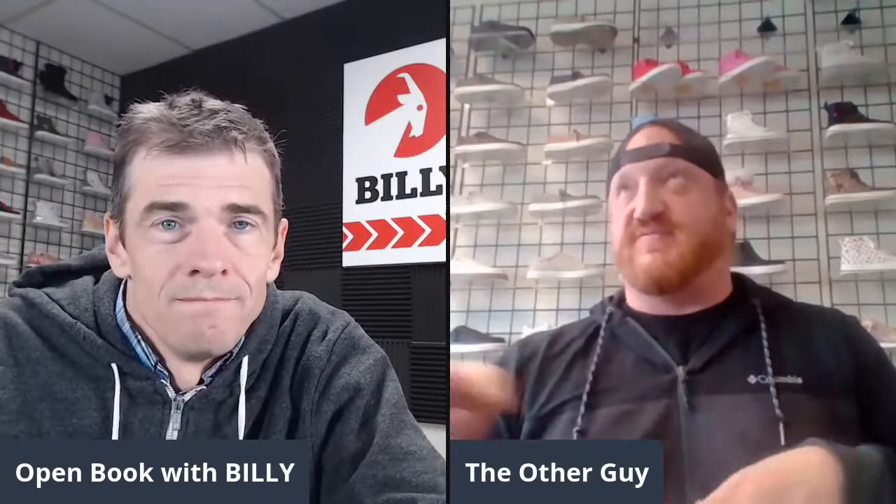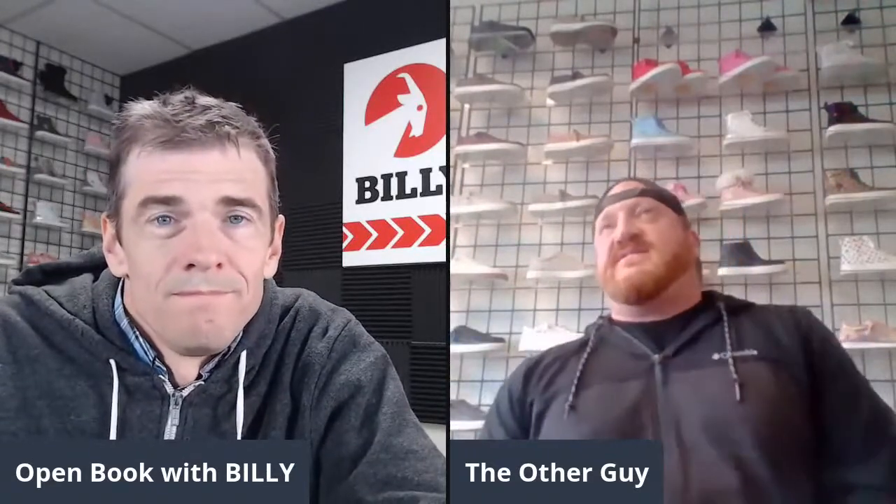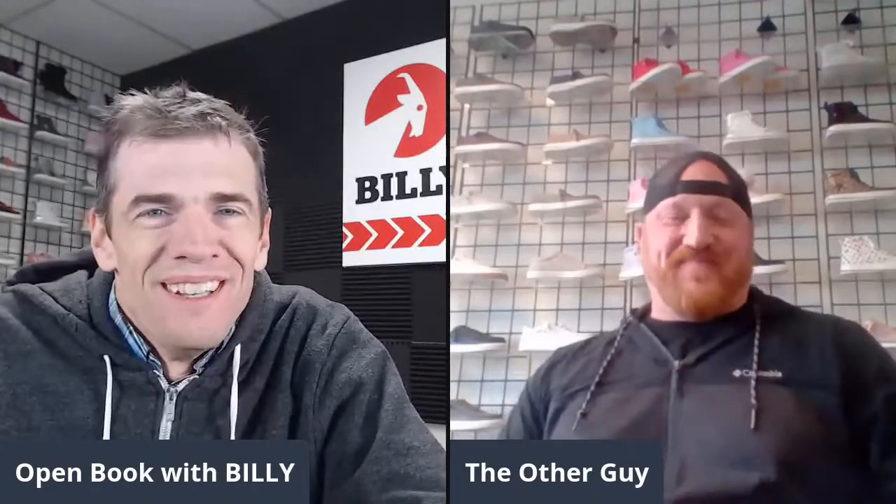Yeah, it's kind of interesting. The first time I developed shoes, it was actually a boot and I received them separately — it looked like I had a bunch of moccasins with these outsoles that needed to be cemented together. That was my first time knowing that the outsole is done at the last step of production. It's really interesting what you learn and how much goes in. There are other styles too — like Vans' vulcanized outsole, which is a heat treatment bonding process, or injected molding, where it bonds to the upper. And then dress shoes have welting-type construction. Amazing that we've worn these every day of our lives without knowing any of this.